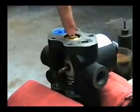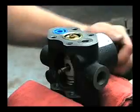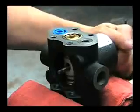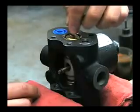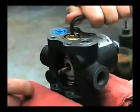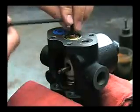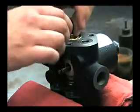To remove the cup, which is underneath this cup spreader, you want to turn the keyway of the shaft facing straight up. The reason being is that when you take out this center bolt, this connecting rod is going to turn in there, and if the keyway is up, then it won't shear off that grease fitting. If you do break it off, you can just drill it out.